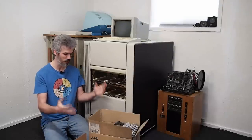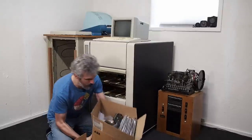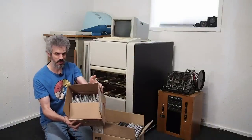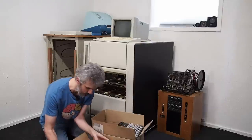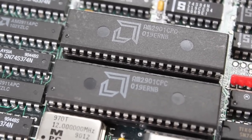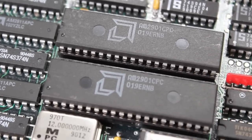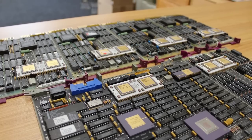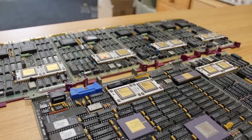In the previous episode we met up with Mike down in Austin who hooked me up with essentially both of these boxes full of PDP-11 QBus cards — either 1173 or 1183. These cards look something like this little drive control card, which has a pair of AM2901 bit-slice ALUs on it. I think there's enough in here to build up like three complete PDP-11 systems, and ultimately I was thinking I wanted to build up two systems.